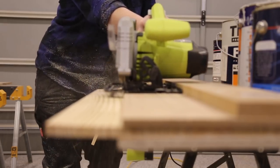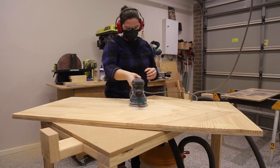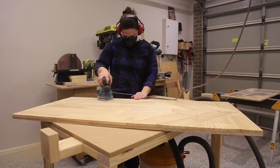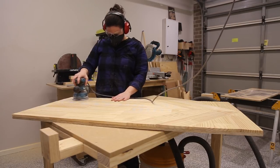I made my way around the board making sure that each cut was straight and square. I then started the job of sanding. A belt sander would have been really handy but, like always in woodworking, we use what we have — so I used my orbital sander. Got the job done. I sanded everything flat and up to 220 grit.